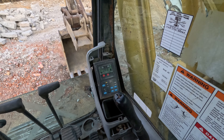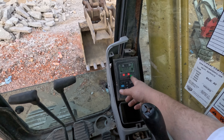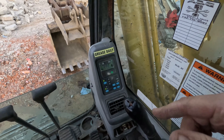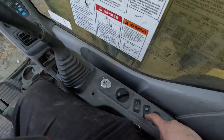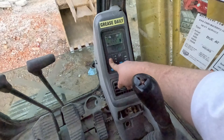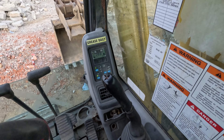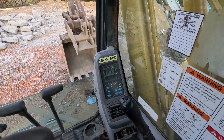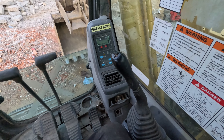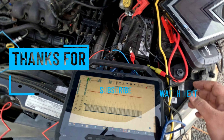To clear it, keep holding the buzzer and turn the key off — you don't have to hold it since it's a switch — then turn it back on while holding the buzzer. His screen didn't show the error after that, so it could be that I actually have the physical problem and it won't let me clear it. Either way, I'm done. At least the buzzer stopped, so it's drivable without that beeping. I try the sequence once more — Error 233 is still there. Alright, that's enough. Thanks for watching.